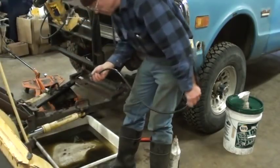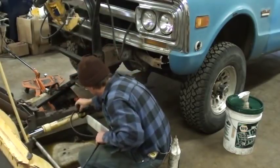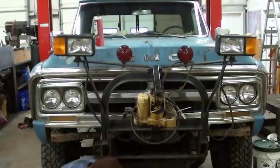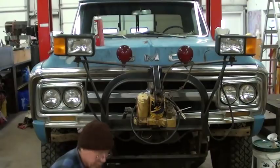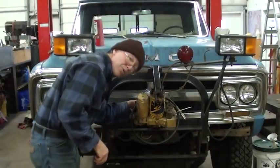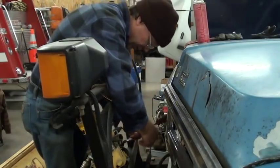Why, that's all one piece, it's not a separate one. Well, there's an expense. No wonder it wouldn't come off here. Well, I'd much rather have to replace a hose than find out I have to replace a ram. Then there's the matter of the pressure regulator spring on the backside. I'm trying to leave the adjusting screw in the same position.